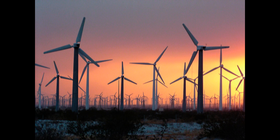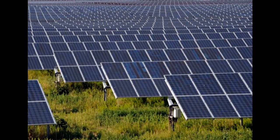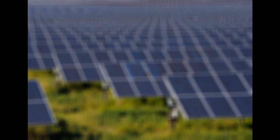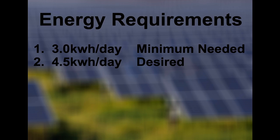It's easy to find a place to put excess electricity, but it's more difficult to add more panels and wind generators after you already have an installation. Putting on extra power generation is less expensive and not that much more work when you're already doing it than adding it later. My own calculations were as follows: my basic needed kilowatt hours was 3, my desired kilowatt hours was 4.5. But my desired kilowatt hours still left out things like the clothes washer, saws, drills, and air compressor. This is where I throw in everything — I still need the power input to support those. So my total good living kilowatt hours calculation was 5.3 kilowatt hours.